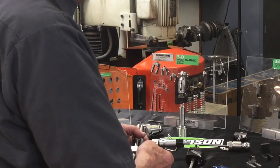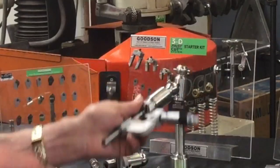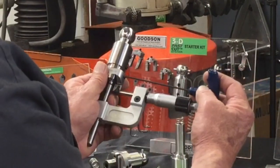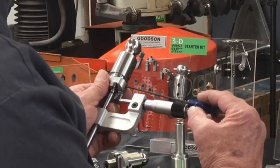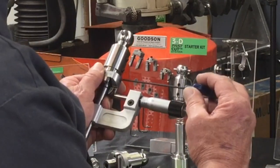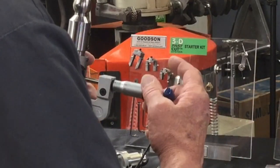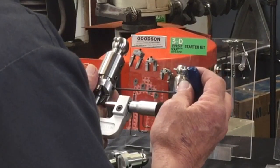I've got tension set. It may look like a little bit of a gyration to handle the tool, but if you hold on to it like this and try to put that blade right in the center of this carbide anvil on the micrometer, we can then efficiently start bringing that tool out. Once that tool is making contact with that anvil, we have hit that 1.490 size. Double-check the dimension and back it off just a little bit.